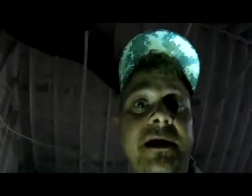Basically, we'll glue it. I'm going to show you how I clean it. Once I do that, I'm going to glue it, pop it back together, and see if that outside unit comes on. So let me show you how to do the drain first. Like I say, it's just tough doing this by myself and without a light. But see, watch. I just take it right here. Yeah, I can tell you that's what your problem was. The drain was completely stopped. When you blow through it, you can feel the clog blow out, because you'll have resistance where the clog is. Once the clog goes outside, you know that the drain is clear.